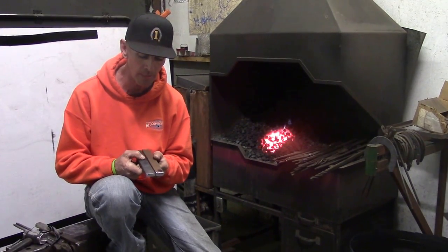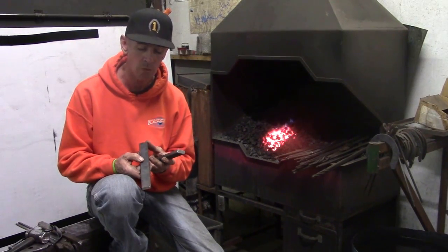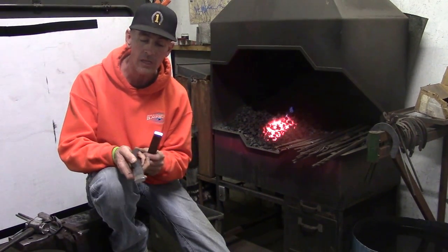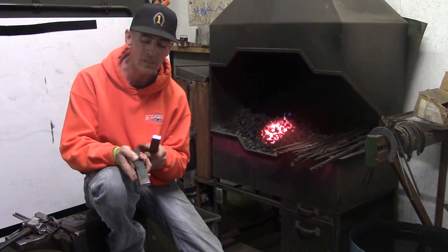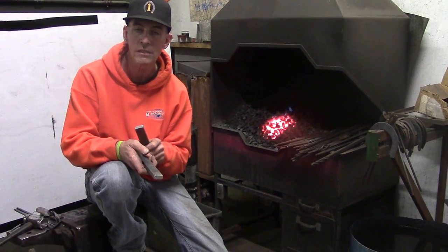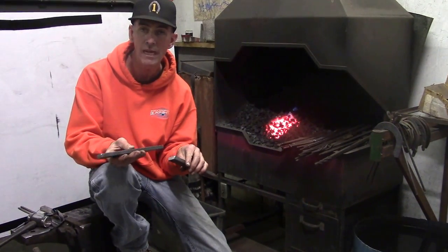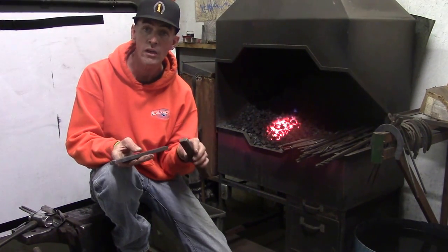And the Masselot clip makes it a little bit tricky because the outside is bumped up a bit. So if you try to make your Masselot clip to where you use the bump, your outside automatically gets shorter because you have an upset outside heel. So we're just going to get through the welding really quick, and then we can treat it like a regular piece of bar stock. And I think that in the long and short of things is the simplest thing, because if you try to get fancy and bump the outside and bump your Masselot right off, then you're going to be long on your medial side.